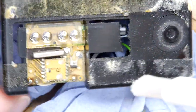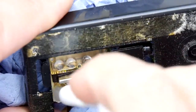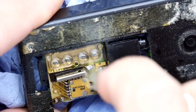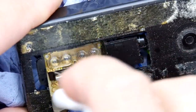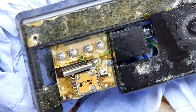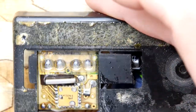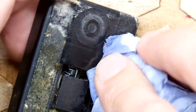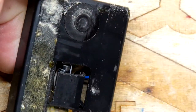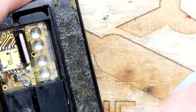Let's try to put a little bit of cleaner on here, and I'm going to tilt the board so I don't get anything going towards the screen side — that's for sure. It's going a bit shinier now. I've got a bit of spare flux cleaner — might as well try to get the old glue off. This will be quite easy to reattach; a bit of 3M tape and we're going to be good to go.